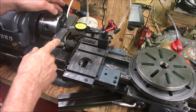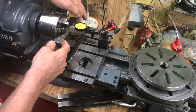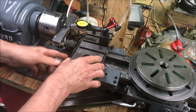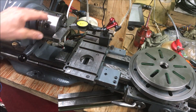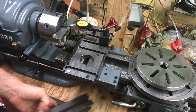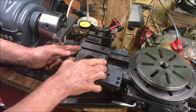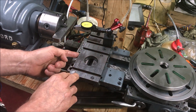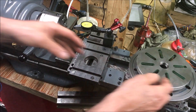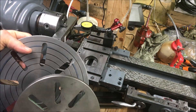So my take on it is to clock up a straight edge so it is equal here and here, and then run the saddle across indicating like that. Like Schlesinger says, you can do it the other way with the indicator here and use a straight edge, or I prefer directly on the cross slide because I have either scraped or at least aligned it, and this is now ground. You can use a faceplate instead - if you have a bigger faceplate use that to get a longer travel.